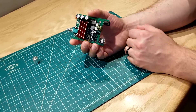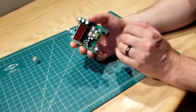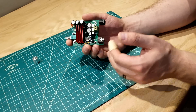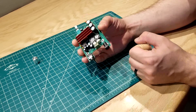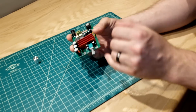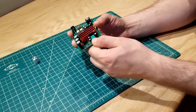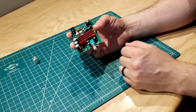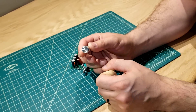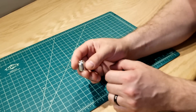This is a mono board designed for a subwoofer, and with that in mind they put a 70 hertz low pass on this board, meaning everything after 70 hertz starts to slope downward. It's really good from 70 hertz down — the board actually specs 70 hertz down to 5 hertz. It also has a potentiometer with an on/off switch, so there's no dedicated off switch; instead, turning the potentiometer all the way down shuts off the board, and turning it back up acts as both on and volume control. It comes with an aluminum-style knob, which is a nice touch.